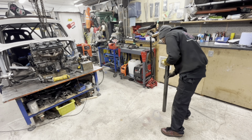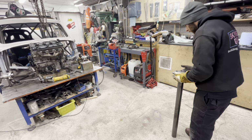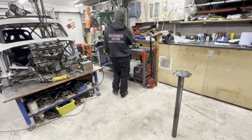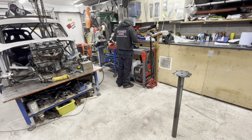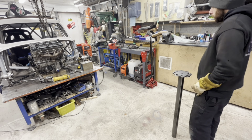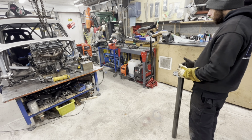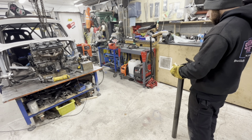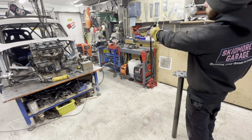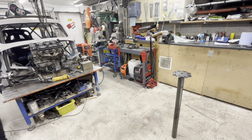That's warm. Now somewhere in this vicinity. I'd say there. Now the holes on this bender are not perpendicular to the actual bender themselves. I'd say they're probably off at about a 30-degree angle. So technically I want these holes, so if I run them 90 degrees to the table, the bender is going to be at a 30-degree angle. So I can't have it going that way, because it'll just hit my material. Let me guess. That's all. And let's measure that angle.